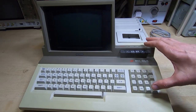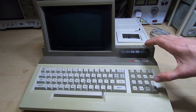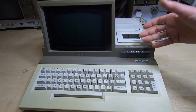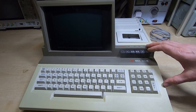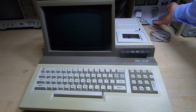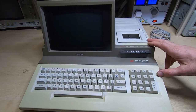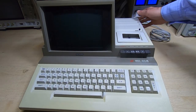I haven't tried powering this up yet. I know that the seller had already powered it up, so I don't have any concerns powering it up. It's not a good idea if you find one of these in your loft — if you don't intend to restore it and at least check the power supply, it's best not to switch it on. But as this has been switched on already, we'll give it a go. I have checked and it is a 240-volt version, so we should be able to power this up quite safely.